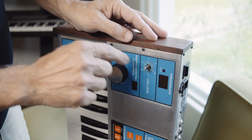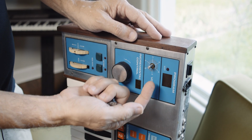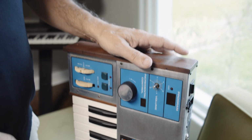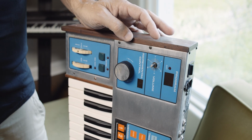And this is an older piece of gear, this Moog Source, and that's where you'll find more of these D shafts that are cut in there more. Most of the modern potentiometers that are used on the Juno G and stuff of this more modern era, the shafts are pretty identical cut. So most of the D shaft knobs will translate, but you just got to be aware of that also. So you have to consider, first of all, the three types of shafts. Is it a round shaft, a knurled shaft, or a D shaft?